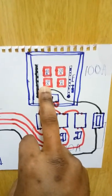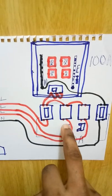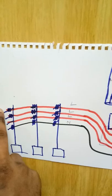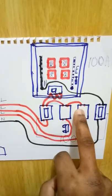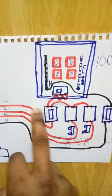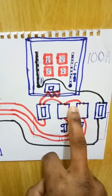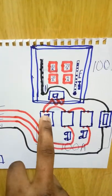This is a 100-amp distribution board — the distribution board also has its own amperage capacity depending on the loads you are going to use in the house. The three phases come down to the three cutout fuses, and you only put one fuse at a time. If you put all three fuses together, you join all three lines — that will cause a disaster, like a short circuit. The three phases are not meant to be joined together.